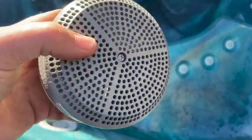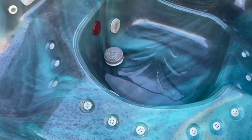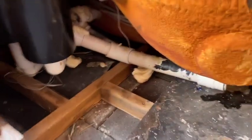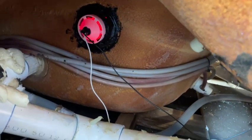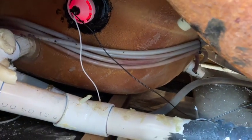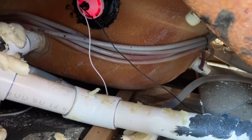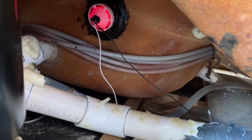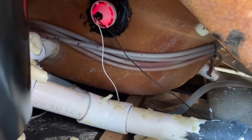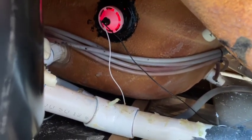You've also got to have a look under the spa to see what's going on. There's a suction there and the light, and we're looking at going just below the light. You need to come down underneath and check — is there room to run plumbing? You can see the light glowing red from the sun shining on it. Basically where we're talking, there's a heap of tubes running past. They've got a bit of play so we can push them up and down a bit. We'll have to get them out of the way when we drill, but we'll be able to get the plumbing past. Worst case we could cut and lengthen them, but in this case they'll just push up out of the way.